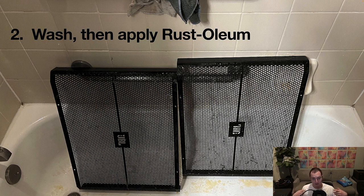You can spray the Rust-Oleum on the brush and apply it, then just let it sit for about 30 to 60 minutes. Then rinse it off and dry it with a towel, because without the paint, bare metal will rust again very quickly. You may need to do it multiple times like I did until you don't see any more rust. Apply the Rust-Oleum, scrub it — the brush was nice because it caused it to foam — wait 30 minutes, rinse it off, dry it, and then do the process again. I did the front and the back, multiple times.